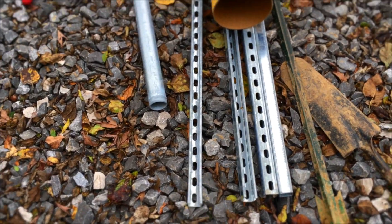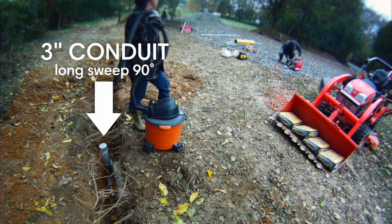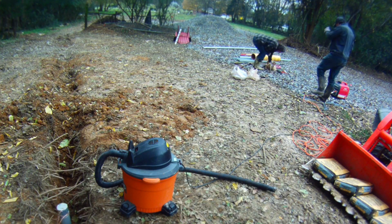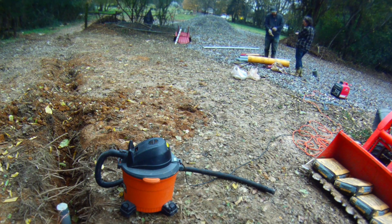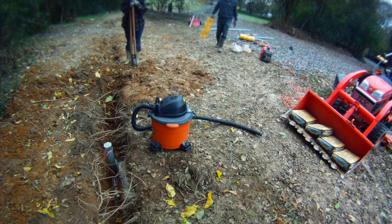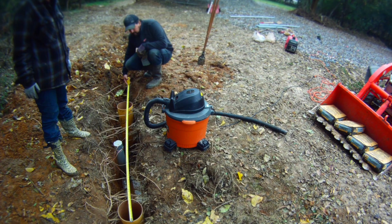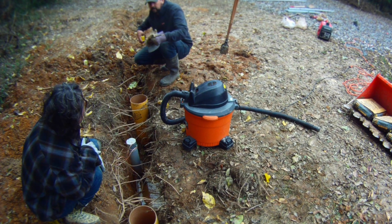So there's four of them — we got four pieces now. We have a three-inch conduit coming up out of the ground that's a long sweep, and that's a schedule 80 pipe. This free-standing meter base is going to be a 400-amp service — a panel for the actual meter that splits out into two separate 200-amp panels, one on each side of the meter.